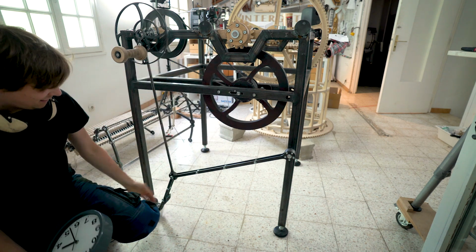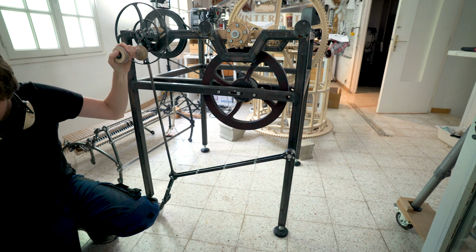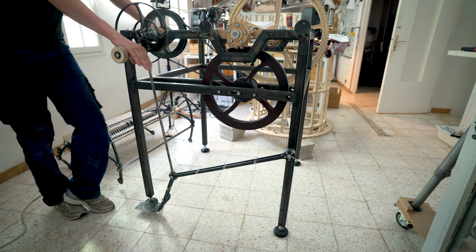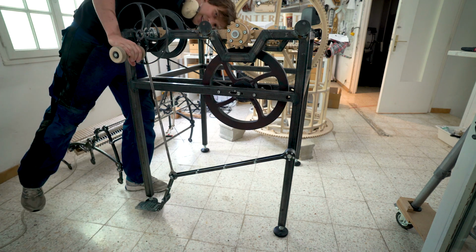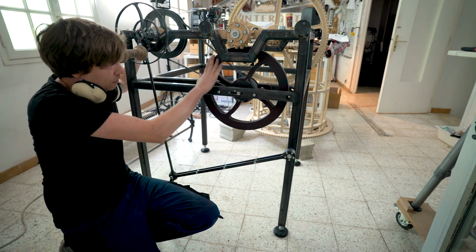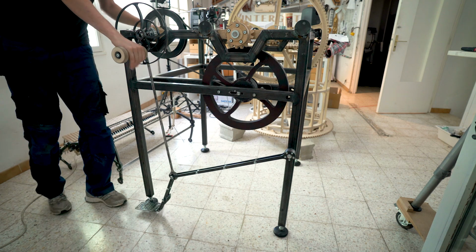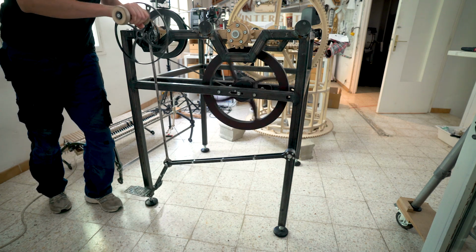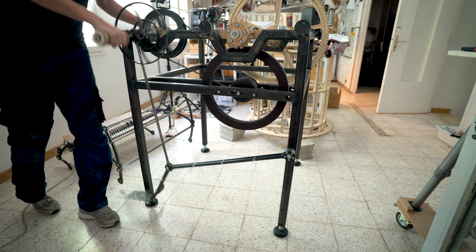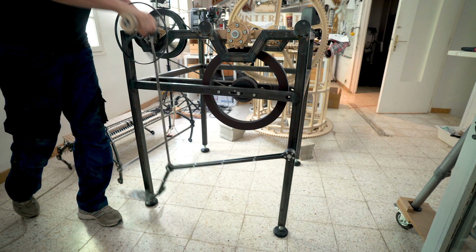Bonus clip! This is the treadle pedal, this is the flywheel, and this is the flywheel pulley, and this is the crank handle that we've been able to put together. This is a lot of Alex's work over 2 days. And I was so excited to try this out because in CAD we've been calculating how much moment of inertia we want from this flywheel and made it quite heavy and geared up, and this is the result. It feels exactly the way I want it to feel.